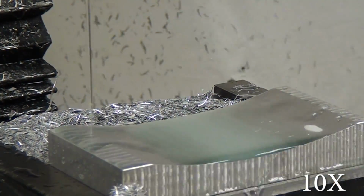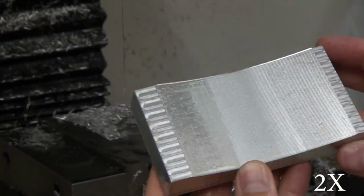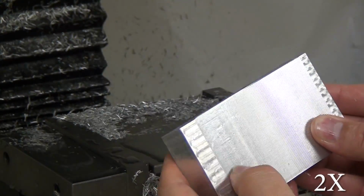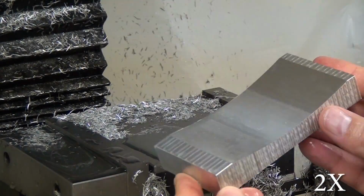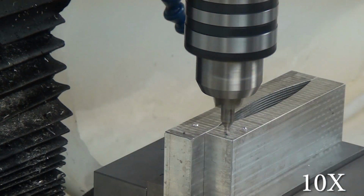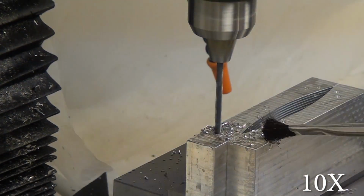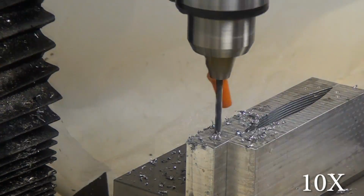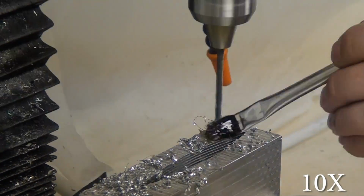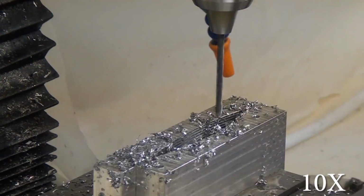The one thing you will need to do is drill 4 holes in each standoff. 2 of the holes are for bolting each standoff to the mill head, and then 2 more bolt holes are for bolting the top plate to the standoffs. I went with 10-32 bolts for the top plate, but in the drawing I'm going to specify something larger, probably 1/4-20. There's a bunch of reasons for that, but just know that it will be easier to machine if you go with the largest possible bolt.